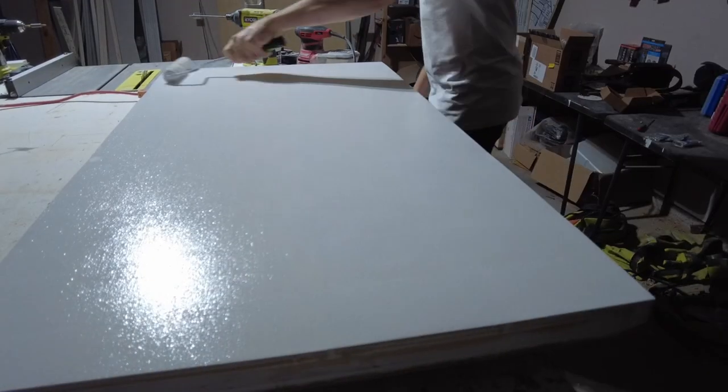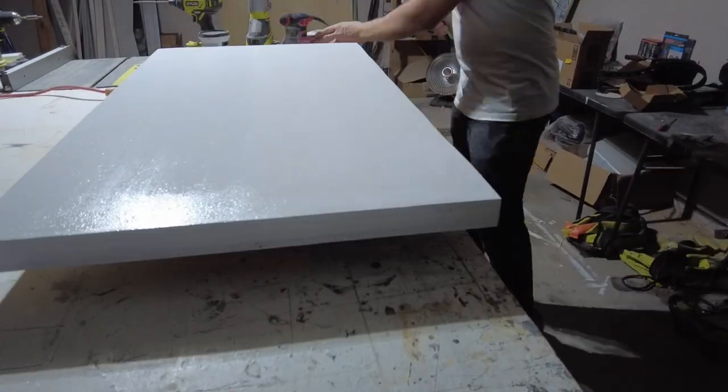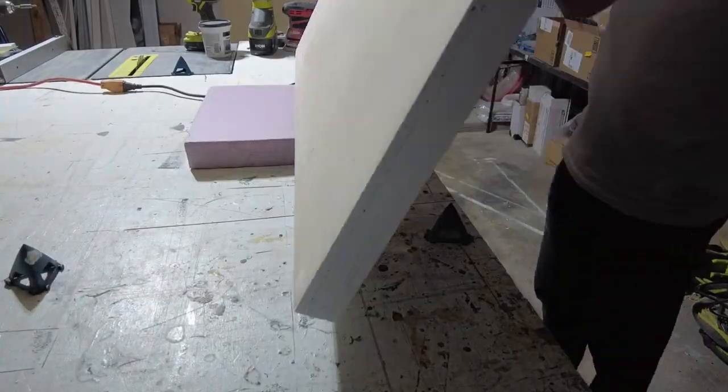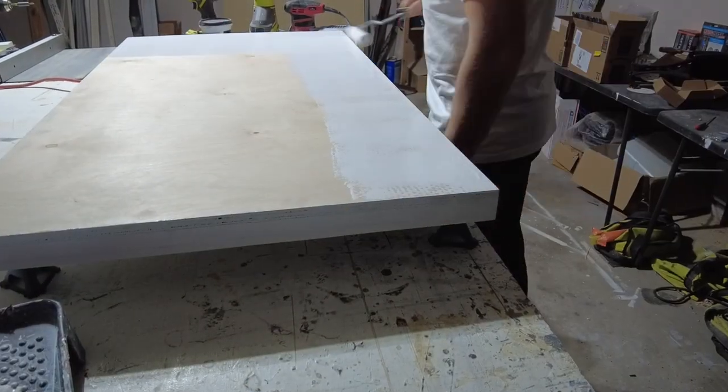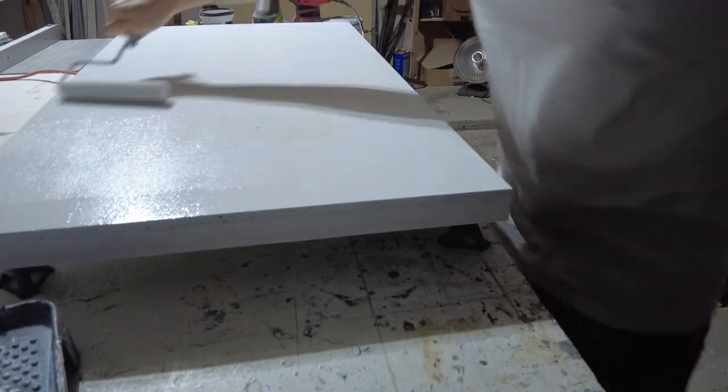One efficiency upgrade I'm going with on this process is a 2-in-1 paint primer enamel. Instead of a two-part system for the cabinet and kitchen trim — where I used the enamel primer and then the enamel separately — this shortens the build process, and I find that this enamel performs just as well as the kitchen enamel.